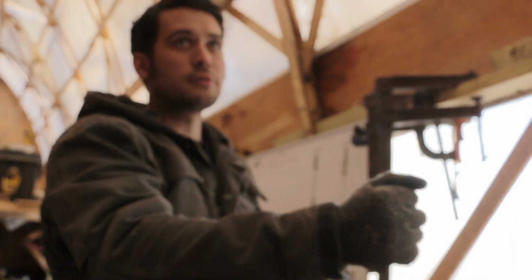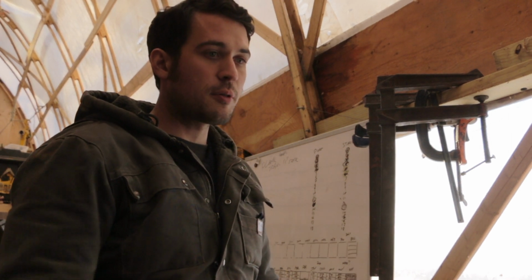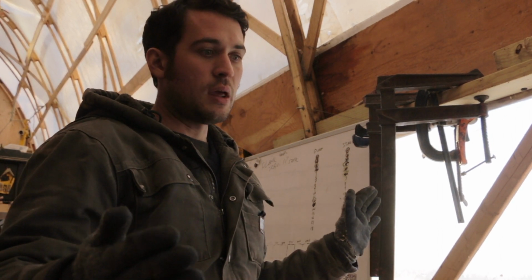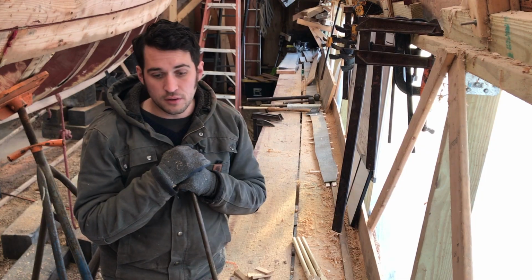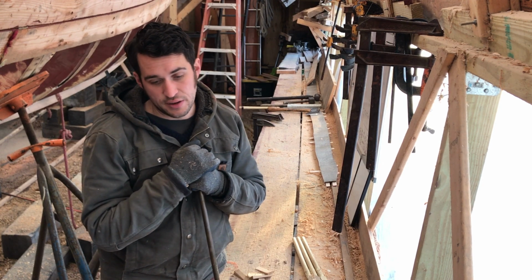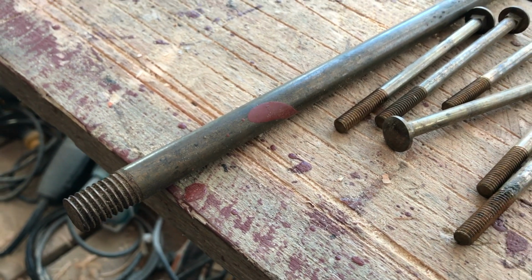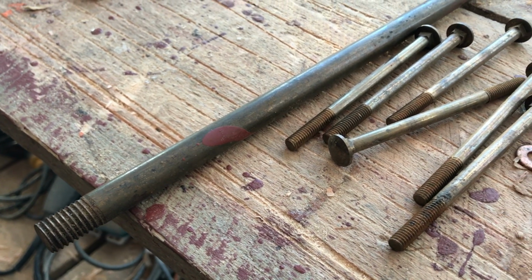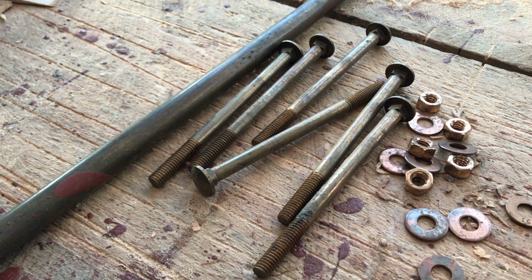So copper and bronze, they're fine together because they're very close. Also bronze and lead are really quite close. When you go from a non-ferrous metal to a ferrous metal, that is a big jump, usually. It depends what it is and where it is on the chart, but the further apart they are on the nobility scale, the more problems you will have.